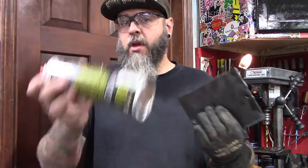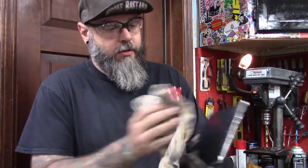Now, if you're going to be welding like we are to these pieces, you got to get that oil that you use to lube the bit off. Brake clean's cheap, easy, simple, or acetone, but you can always find brake clean around and you don't waste it. So just spray it down with brake clean. Keep a rag around you just use for moving brake clean, and wipe her down.